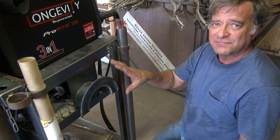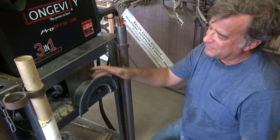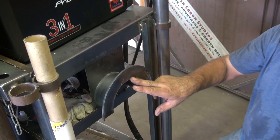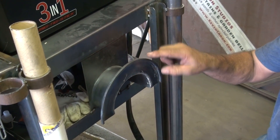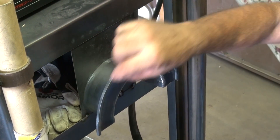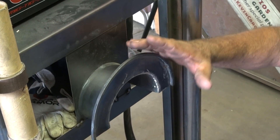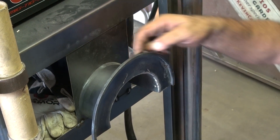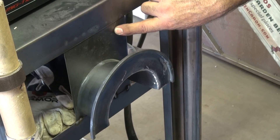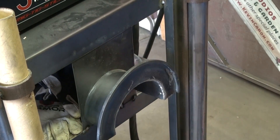You've got to have some place to hang your torches, cables, what have you. So I made these little half-hose reels — bent this in the slip roll, cut this out with the plasma, welded that together, and then came in with this quarter-by-quarter solid stock and fit that to the top of that piece of 16-gauge just to cover that sharp edge so you don't cut the cable. Welded it on both sides just to finish it off, and then added this piece of plate not only as support for the shelf but also to give you somewhere to hang the reel itself.